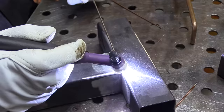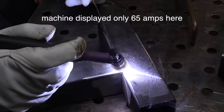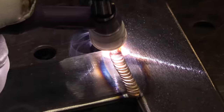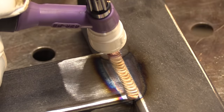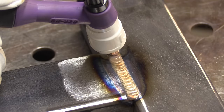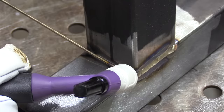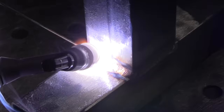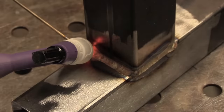Let's try again. The machine displays an average of the pulse background current and the pulse time — right now it's displaying 65 amps. I'm trying to keep the rod in there often; I don't really want to melt the base metal. You can do it if you step out too far ahead of the puddle, so you want to stay over the puddle. Keep the rod in there often, and a cup like this Jazzy 10 really helps for silicon bronze, keeping that puddle clean. The pulse helps a lot keeping it cooled off and keeping the oxides down. Silicon bronze melts at quite a bit lower temperature than steel — about 1,900°F versus about 2,800°F — so you just want to flow the metal into the root as much as possible.